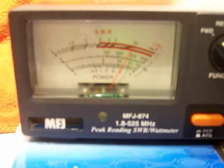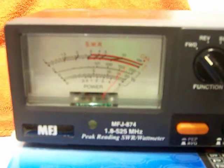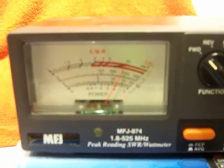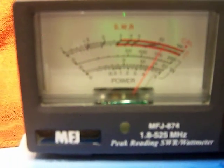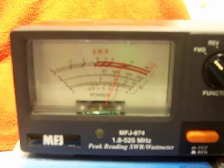On the usable transmit it starts about 420 megahertz and you're getting a full 4 watts. On VHF on 174.9875 you're getting 4 watts, and on 136 you're getting 4 watts output. In memory mode, this is the simplex channel 146.550 — again we're on a dummy load — just to prove it's doing a little bit over 4.5 watts. Here's a UHF frequency, I believe it's 448.150 here in Chicago, it's actually a repeater, and it is doing about 4 watts.